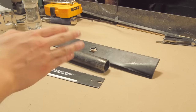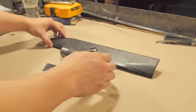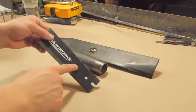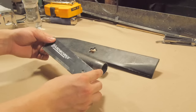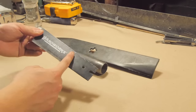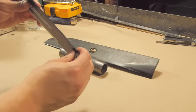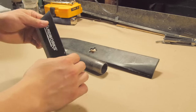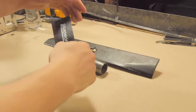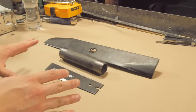Now that that's out of the way, here's the stuff we're actually going to be making the bayonet out of. We've got this lawnmower blade — this is going to be the blade. We've got this one-inch steel pipe, which is going to go over the magazine tube for extra stability. But the main connection point is going to be made out of this high-quality piece of a machete. The reason I'm going with this as opposed to mild steel is because this piece has to be as thin as possible while still being very, very strong — at least strong enough that you can't bend it with your own hands. It doesn't really have to be a machete, but as long as it's some high-carbon, hardened, tempered steel, you should be good.